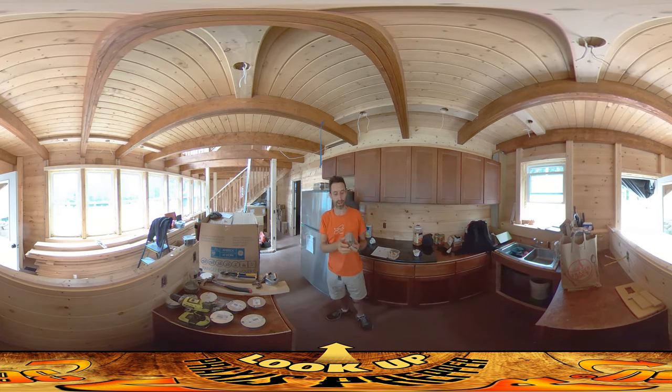If you recall, I had an issue where I had put these metal boxes up there. I'd asked the electrician — referring to wall sconces — you know, I'm using these kinds of boxes for electrical receptacles, wall switches and things. Can I also just use those for lights and things? He said yeah, that's totally fine, same for smoke detectors. I inappropriately inferred that that also meant the same for lights hanging from the ceiling, which it doesn't.